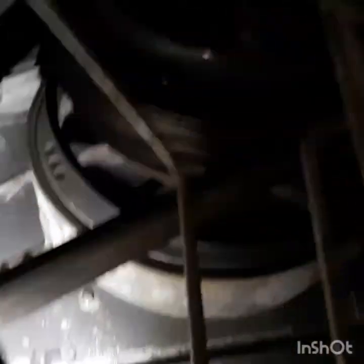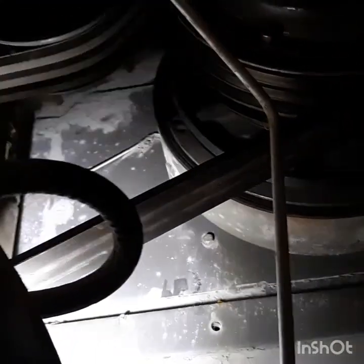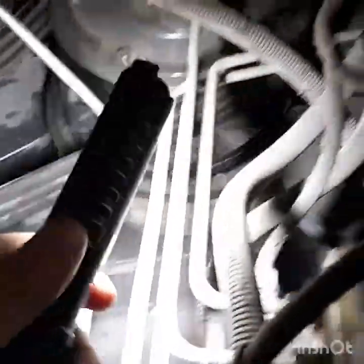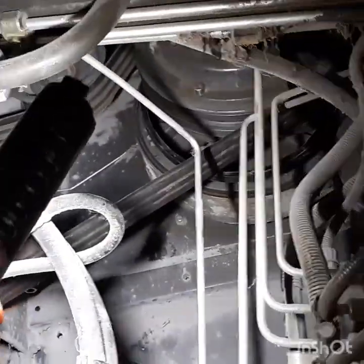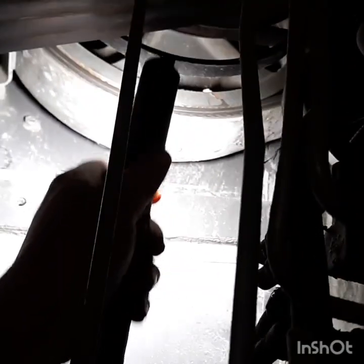Alright, so that ain't too bad. The new belt is hanging there — there we go, focus camera. The new belt's in. You just had to move this big triple belt. The tightener you can loosen down, but you don't want to take it all the way off — you just kind of manhandle it, get it started a little bit, and just roll the sheave over and let the belt run off. You don't want that tightener to come off all the way. Honestly, now that I've done it once, you could change this little pump belt out in about 15 minutes next time.